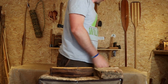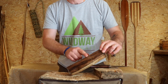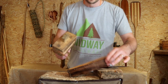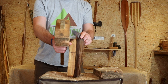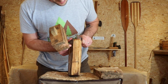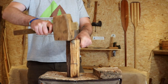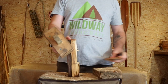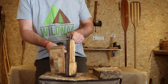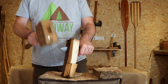There we go — one line there and one line there. I'm going to get my knife and my tapping mallet and, on the handle end, making sure I'm inside that stop cut, I'm just going to batten off a piece like that. And the same on this side, making sure I'm well inside that stop cut.